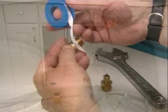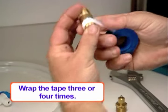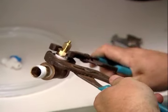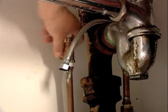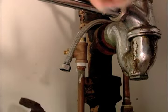It starts by breaking this connection right here. To make a water-tight connection, I'm going to put Teflon tape on all of these threads, and now tighten them up with a pair of pliers. Now I need to thread this T onto this threaded adapter - righty-tighty - and then make it up with two wrenches.